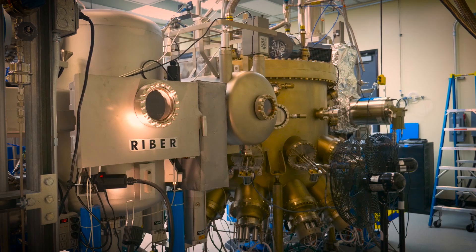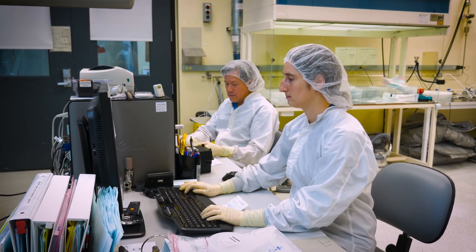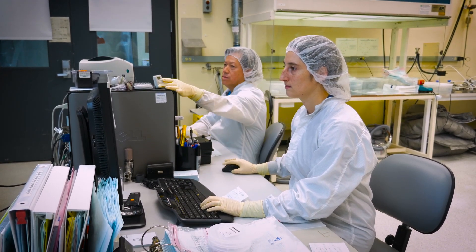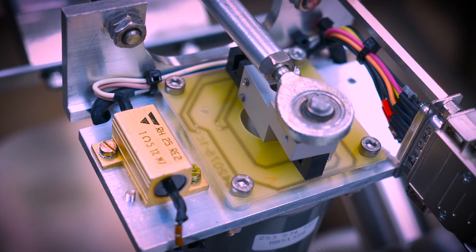The process is called molecular beam epitaxy, and it's a process where we have atomic layer control of building our gallium nitride crystals. We use gallium nitride over silicon or gallium arsenide because it can handle much higher power density. Wafers like this are being used in satellites and for mobile communications.